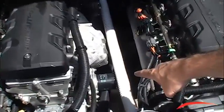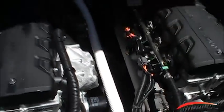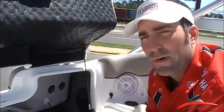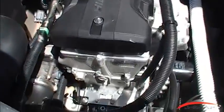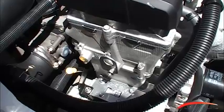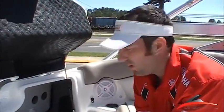You notice there to the right — unlike the previous year model boats, these motors are not the dry sump system where you need to check your oil when the motors are hot. These you can actually check the oil when the motors are cool via a dipstick that goes in down low. If you see the dipstick there with the yellow handle — it's a lot easier to do. A lot of people got confused before and added oil when it was already full.